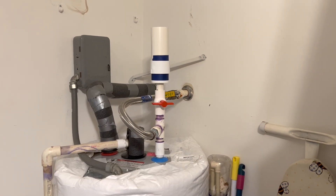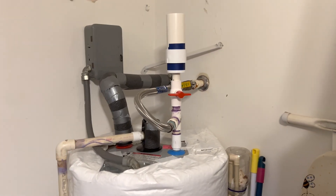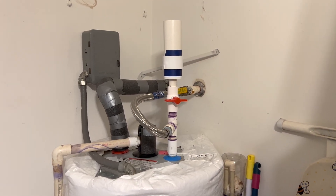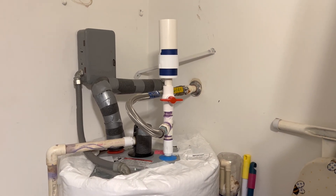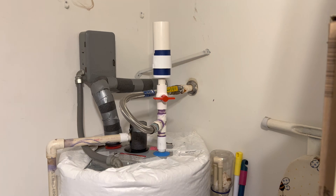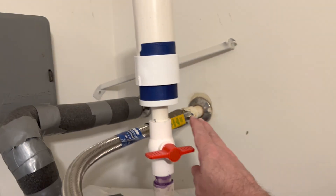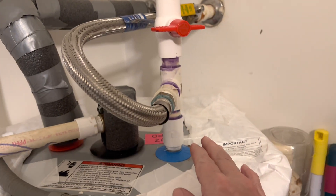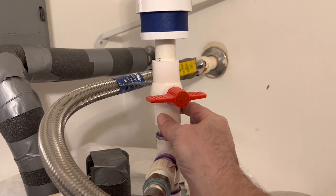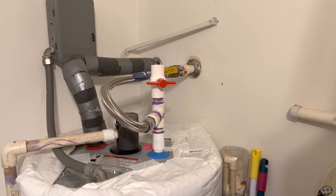If you want to put peroxide or Clorox into your water heater — like I need to occasionally because this water heater sits around for several months without being used — there was a video by a YouTube user named Apache Ranch who put together a nice detailed video. I took some of those ideas and made my own system. What we see here is the cold water source has a valve, and I put this T with the source going into my T, then I put a ball valve here and this is really just a funnel that I can remove so it's not sitting there all the time.